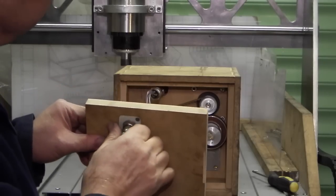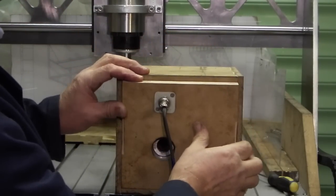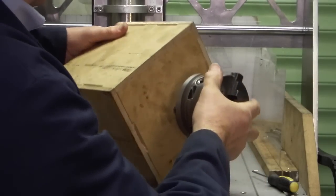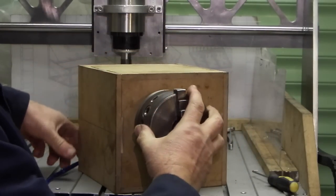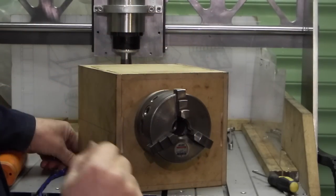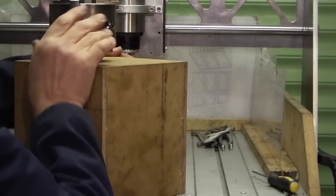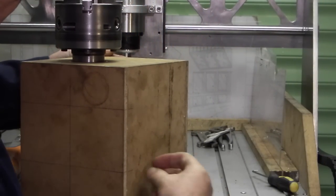The other thing - I made this when I made it, it's only made out of MDF as a prototype. But the main idea was with the chuck offset I could turn this box round, and I've got different positions for that chuck so I can have it lower or higher on the machine. I haven't tried it in the lathe yet but that was the idea - I could move it up or down in the lathe and also as you saw on the drilling machine I can orientate it that way. I think I might put another access point for the cable so I can put the cable in either side.